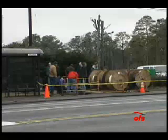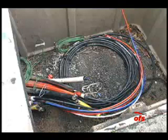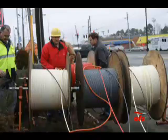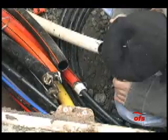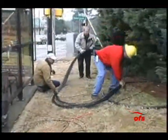The installation started at this handhold where you can see the existing 1.5 inch conduit as well as the end of the previously installed microduct and micro cable. As was done in the 15 mile route, they intend to install six 1210 microducts into one of the empty 1.5 inch conduits and then install OFS's micro cable into one of the microducts.